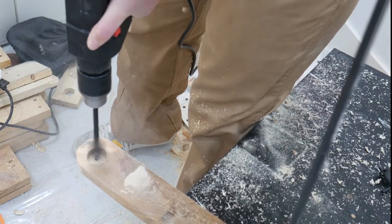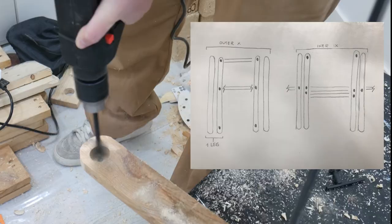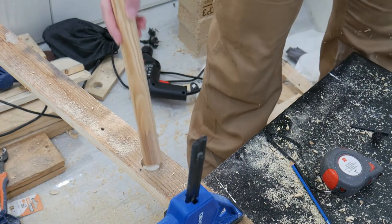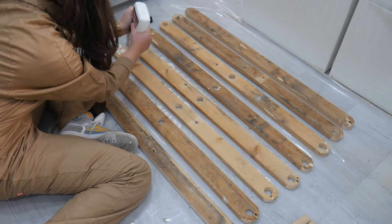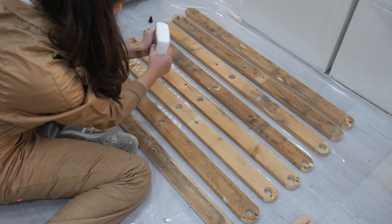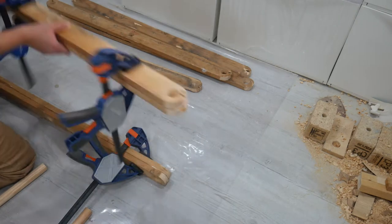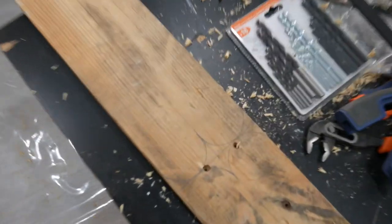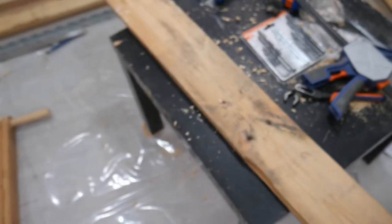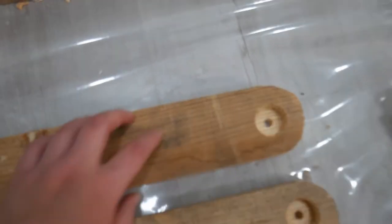I'll include a diagram in the description for the exact placement of these holes, since I ended up drilling too many and had to fill them later. After that, glue each piece to its partner and wait for them to dry into four leg pieces. I used leftover wooden poles to ensure the holes would line up, and later trimmed any excess with my jigsaw. While that dries, cut from the same 6-centimeter wood strip two 50-centimeter pieces and two 16-centimeter pieces, rounding the edges as you did with the legs. For the shorter pieces, drill a hole at one end and on the other side go only halfway through.